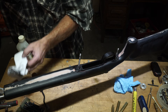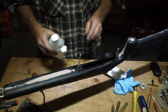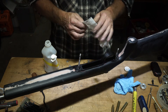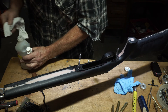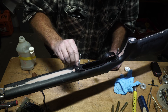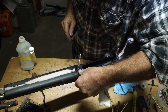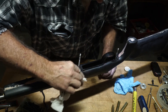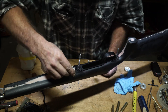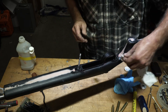All the cleanup work, all the body work, all the nice aesthetic stuff to make it look good will be done later. Right now we're just giving this something that I can tighten to. This is white vinegar — I just took an old isopropyl jug and put some white vinegar in it. Smells like chicken wings. But white vinegar is a great solvent for epoxy, for AcraGlas. It's an old cleanup trick from the gunsmith's kinks book. All we're doing is getting rid of the excess — I'm not going super clean here because this all gets sanded out and finished later.